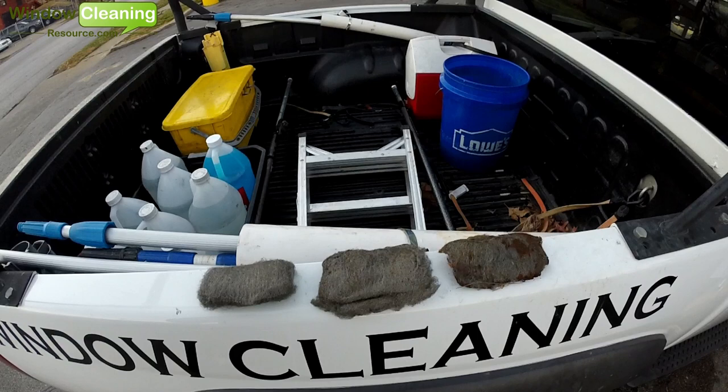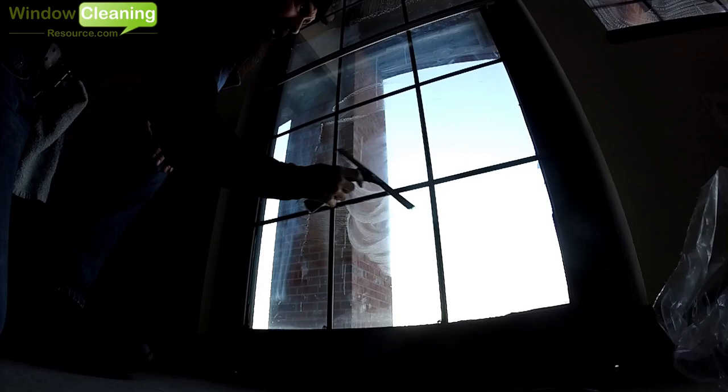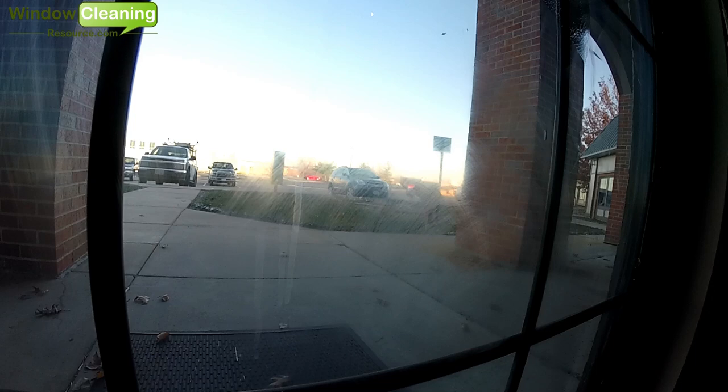Never use any of the three pads on tint. We were lucky enough when filming to have a tint removal, so I was able to demonstrate exactly what steel wool or any of these abrasive pads will do to tint. You can see here that it scratches it and leaves swirl marks in the tint. Use caution if you ever suspect that the window is tinted — talk to the property owner and ask them if the windows are tinted. If they're not sure, look at the window and you can usually find a tint line where the tint stops and the window begins, right around the frame of the glass.